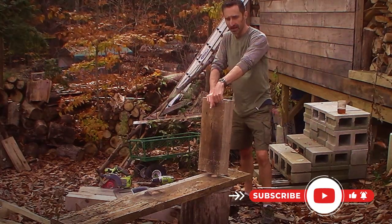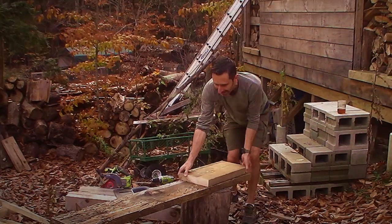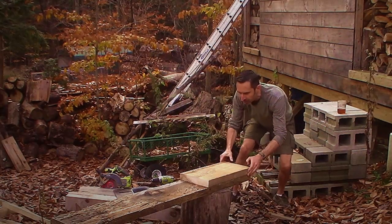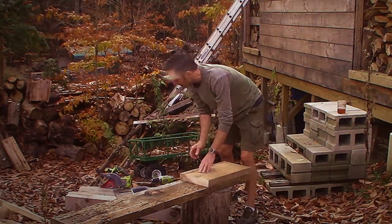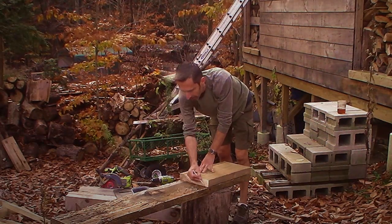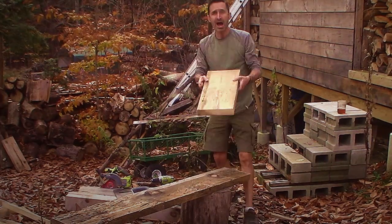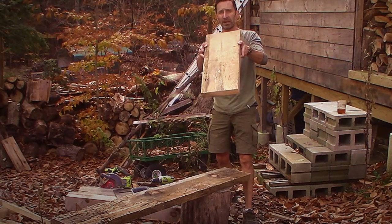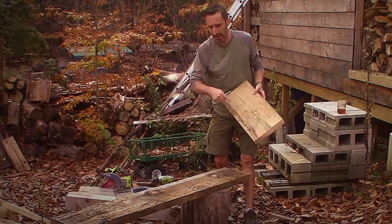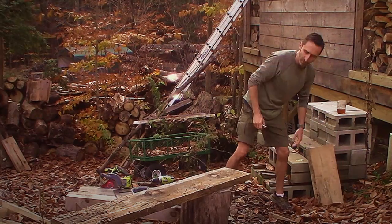Because what I was thinking of while I was talking about that is whether I want to make a new mark, 22 inches, or if I want to just take this and use it as a template and save myself some time that way. If you want really precise measurements, it's usually best to remeasure it every time, but you can do a template also. And I'm going to do it on this one because precision isn't all that important. Although it's important that I use this as the template every time so I don't make a copy and then use the copy as the template next time, because any errors will keep compounding and compounding. So this will be my template for all steps that follow.